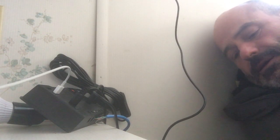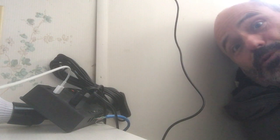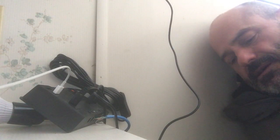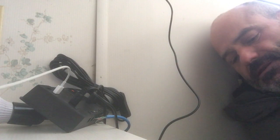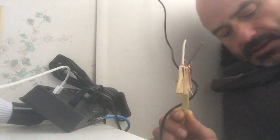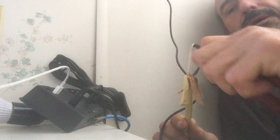As you can see, I just cut this off. I'm going to use my utility knife — I'm crunched down here in the corner where I'm wiring this, so I look even funnier than normal. I use my utility knife to cut back the outside. I've done some talking about whether I should strip it back and separate the wires out, and they suggested just leaving it as is. It's only about 10 feet of Romex, so I'm leaving it all together. Since I'm not using the ground, I just have a positive and a negative, and I'm wrapping the ground around to keep that outside insulation out of my way.